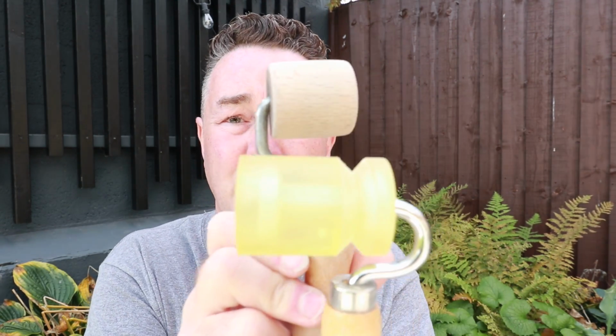You've got, you can see, that would roll your edges or your wallpaper into an internal angle. I'll come on to that in a minute. This is like a traditional seam roller style, i.e. one like that, but look at it, it's bigger. And it's also got a V-cut, 45, well is it 45 degree? It's probably not that. Oh, I don't know what degree that is, might be a bit more. A V-cut there, which is to roll down your outside external angles. Now I've been using this because Mike says give it a go, see what you think, because I do quite a bit of papering.